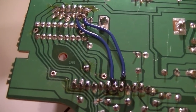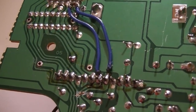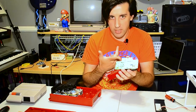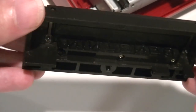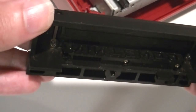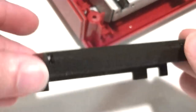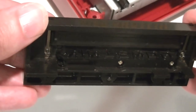Here's the completed hack. I basically had to run two wires from the connection for the RAM adapter all the way down to the disk drive header, and I also removed two jumpers and cut some traces. We now have a disabled security chip — if this thing was going to give us any headaches, it is not going to do so anymore. You can also see the word Nintendo embedded into the plastic on the back of the drive door. That's because the disks themselves had the word Nintendo engraved into them with letters at different heights — apparently some sort of security measure to keep people from making unauthorized disks. But all I had to do was unscrew the drive door — just two screws — so not a very good security measure.